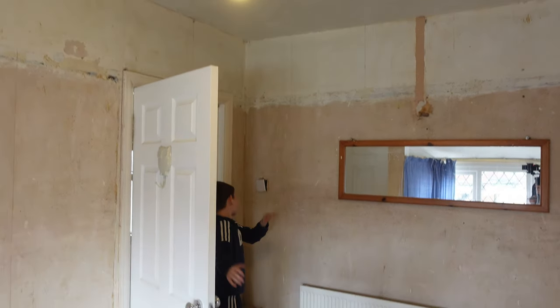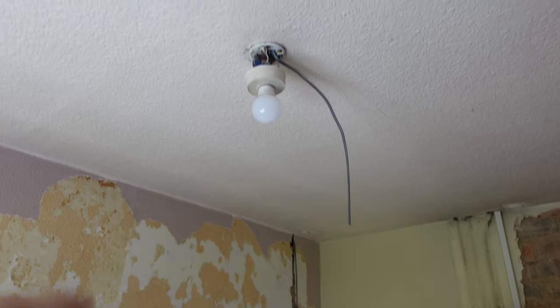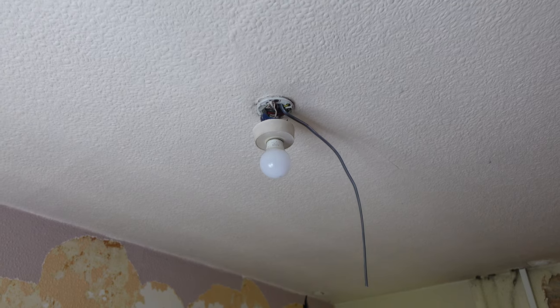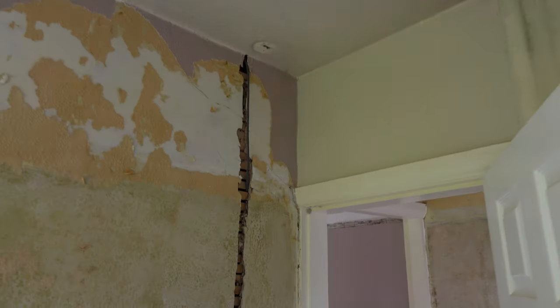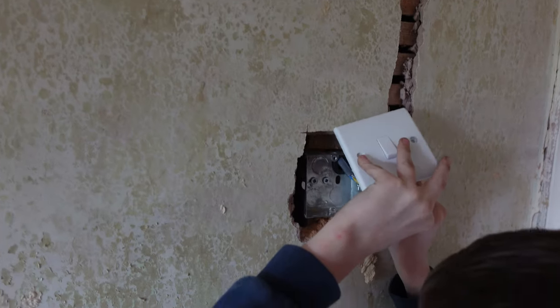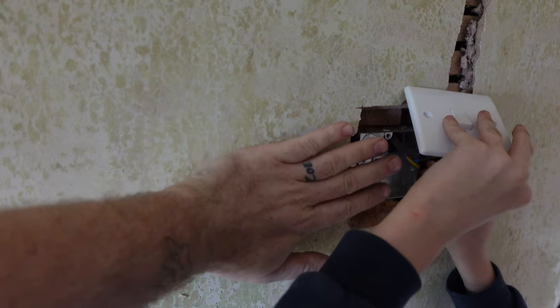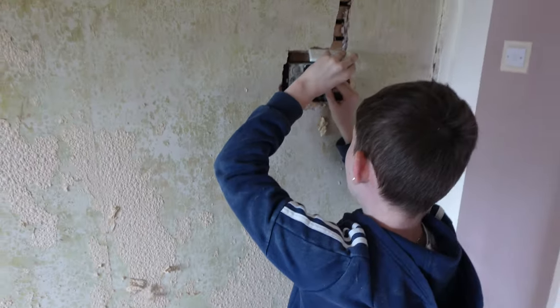Pull cord's off. What I did was take this light down, poked the cable up, James pushed it up for me, I got in the loft and took it over to our new point. Chopped down and then realized the wall is lath and plaster, so we've tucked into the wall there, found the closest upright joist, chopped it out a little bit just enough to get the box on, and James is just connecting it now.